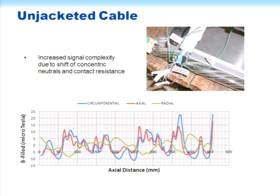And I think the one that's most easily noticed is the blue one here, which is the circumferential magnetic field. And if you notice from this plot, you can tell actually the spatial periodicity of the CNs, because there's a region where some of the CNs have slid from this region over to adjoining regions, so they're kind of bunched up here. There aren't many here. And as you look at this diagram, looking at the blue curve, you can see, okay, here's a signature of that. Same thing repeats here. Same thing repeats there. So the periodic distance where these things arrive is here to here, for example. And so there is the implication of a lot of information there. And these are fairly new data, so we're still in the process of trying to see how much information we can get out of that.